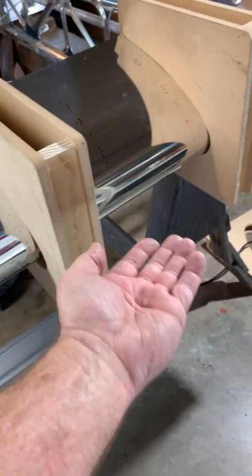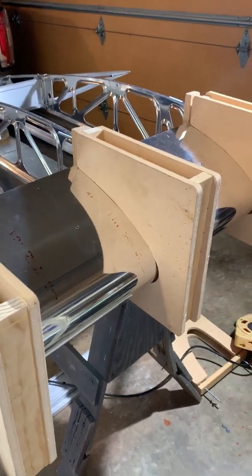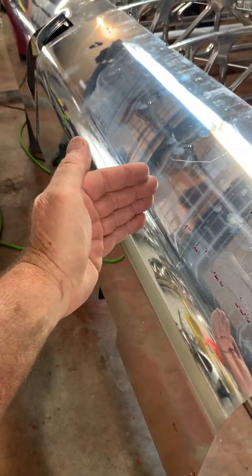I made a whole bunch of these clamps for Cub Crafters — they sent me the pieces, cut them out at the factory, I built the rest and supplied all the hardware and shipped them out. That's why we ask that you only get the clamps after you've got both wings ready. Pull them up until completely tight — always hand tight, never use pliers. It should be flush all the way around. All you want to do is set it against those nose ribs where you can rivet them. This one is easy, but when you get down to the lower ribs you have more problems because you can't reach up underneath there to wiggle them.